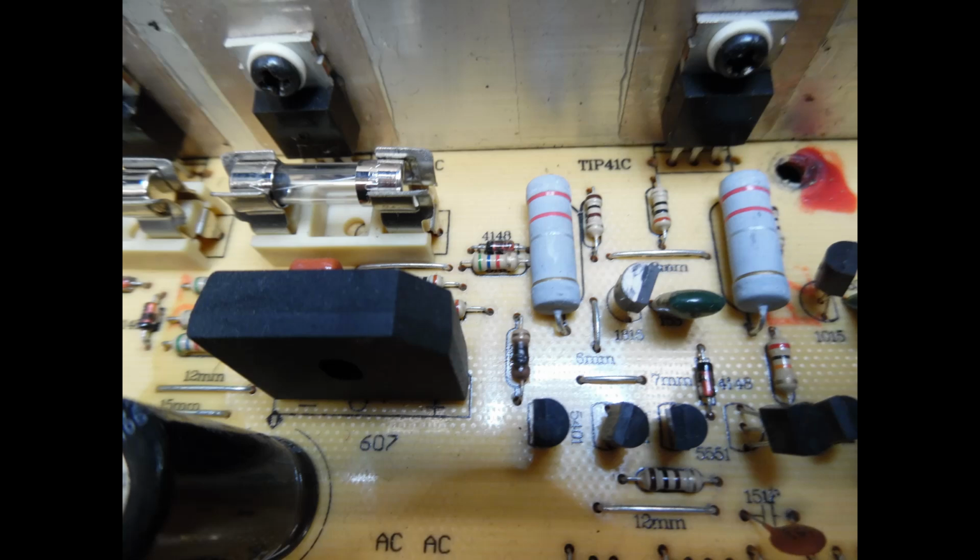And then the thing to do, of course, is replace the fuses. But I would also say, as I have on other tutorials, just squeeze in the end caps where the fuse is connecting to the fuse holders. Often what you'll find is that they spring open slightly and they can become loose. Even intermittent loss of sound on these types of amplifiers, which don't incorporate any form of speaker protection system, you can sometimes find is just loose fuse holders. So just take care of that.